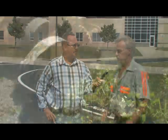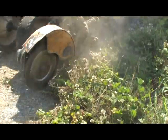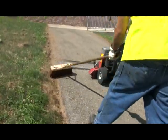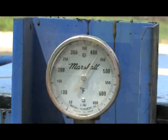Well, it's a lot of work. The first thing we have to do is a lot of preparation. Our preparation involves a lot of cleaning, removing all the vegetation from all the curbs and all the cracks. Once you get it all clean, really clean, spotless, then you put a liquid rubber in it. It's actually liquid crack fill.